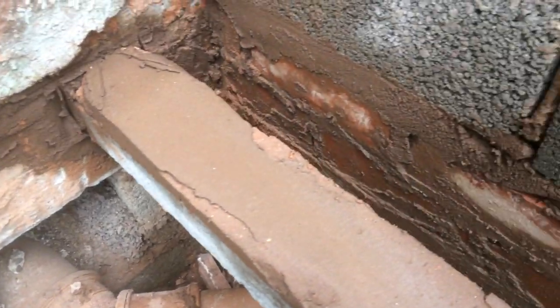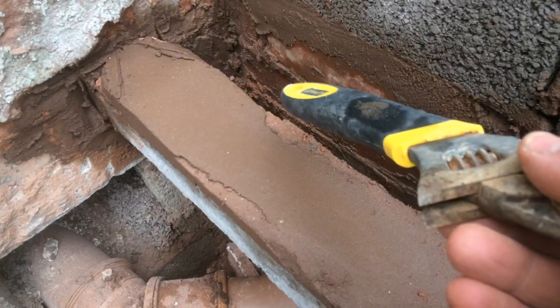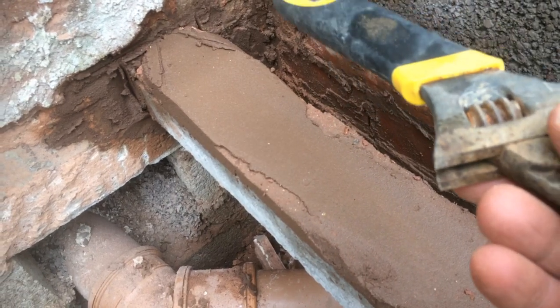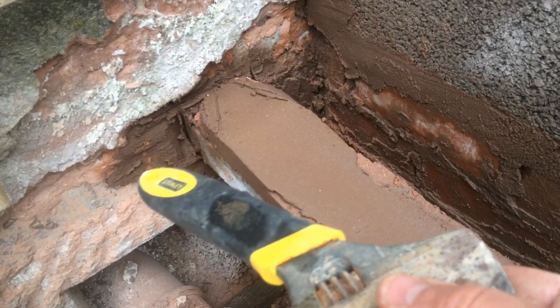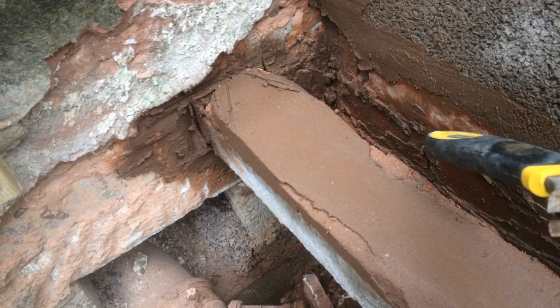The other one on the outer skin, as you can see, I've dropped that down a bit below the lintel — I could do that there. Because there's no lintel above it, so I'm not disrupting this lintel's bearing, and also there are no holes or other lintels down at that level.